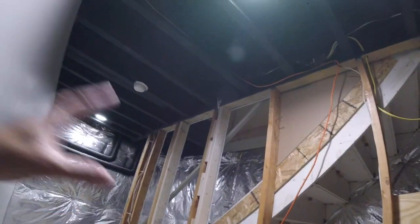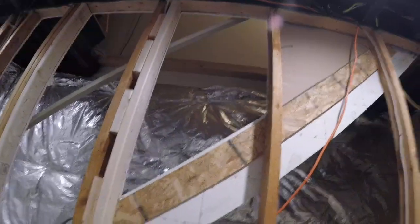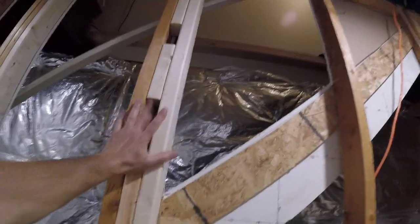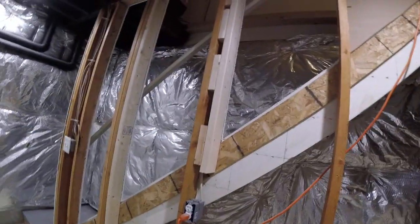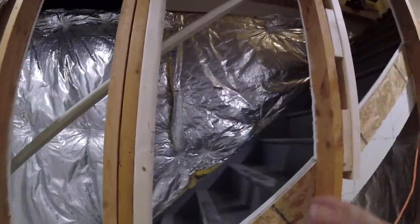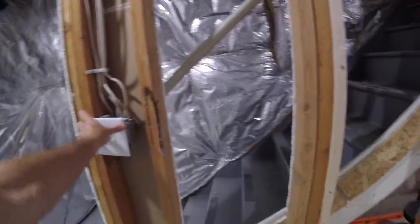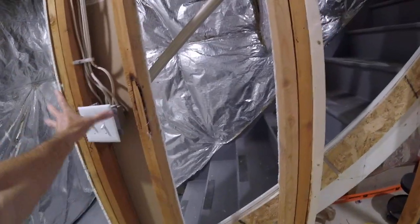The wife really wanted this to be open as you're coming down the stairs. It was kind of just solid drywall on the inside, and I'd put particle board OSB on the outside just to hide it. So I took all that down and followed along. I actually had to add studs because I couldn't do anything with this section because of the light switch, and I didn't want to move it — it works good there. So this is just going to be that wide drywall.